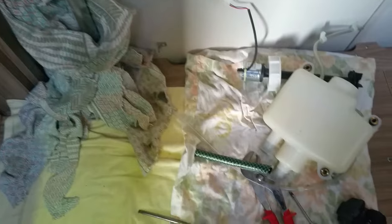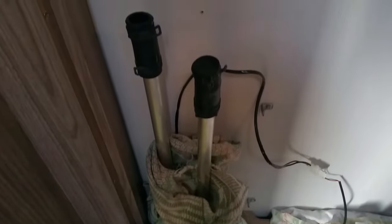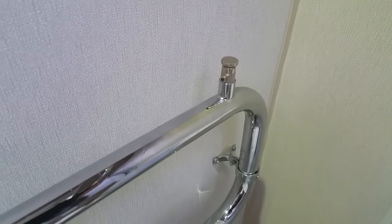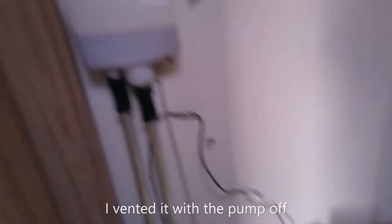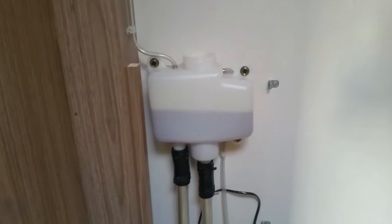I'm now going to put the tank back on. I did get a bit of leakage, but it was easily contained by the rag I fitted around there. The header tank is now refitted and I'm going to top up to level from a jug. I've vented the system at the little vent point on the bathroom radiator — it did get quite a bit of air out and nearly emptied the header tank, so I've topped it back up and I'll check the vent again.